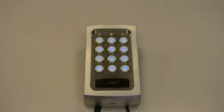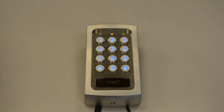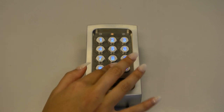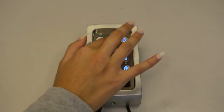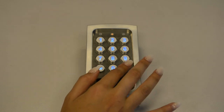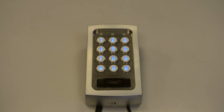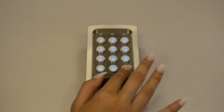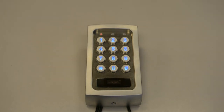To add a pin only to relay 2, it's the same process but instead of entering 10, enter 20 and then enter 2 for the location of programming pin only. Let's say we want to set a code for user 002 — we enter 002 and then enter your four digit code, so I'm going to enter 2582. Then enter hash and star star to exit programming mode. The red LED will show us that we've now entered a pin for relay 2.